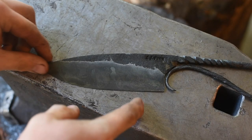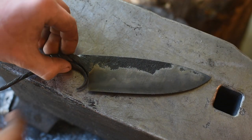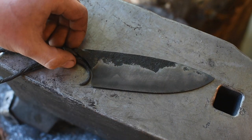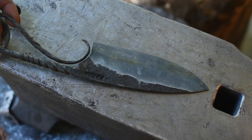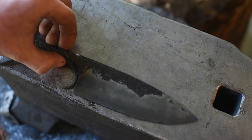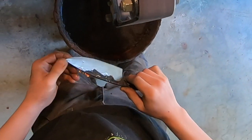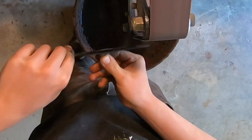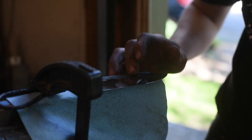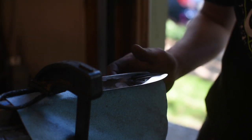So if you can see, we've got kind of a lot of pattern distortion on this side but we've got the edge clear, and here it's a little less wavy. On both sides we've got edge — we've got the 80CrV2 — just a little more exciting on this side. I'll just keep grinding, up through the grits. I took this up to an A30 Trizact belt, so that's about an 800 grit.